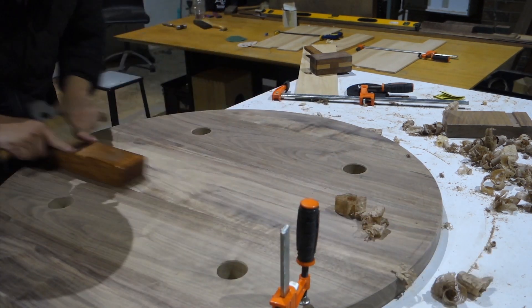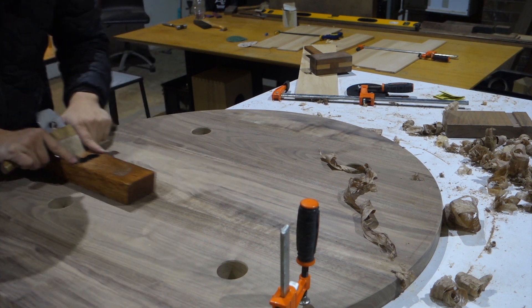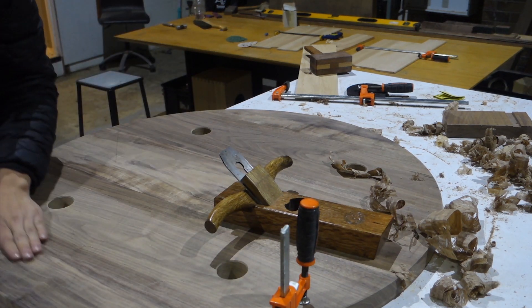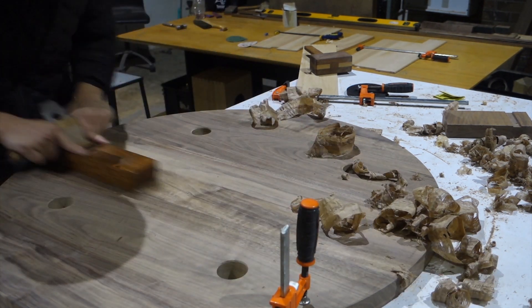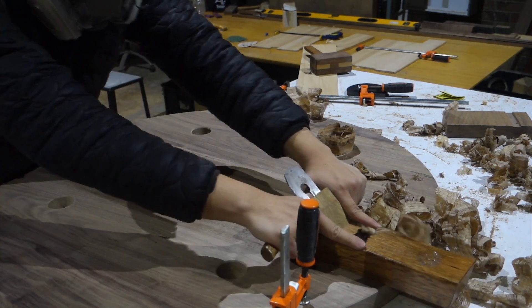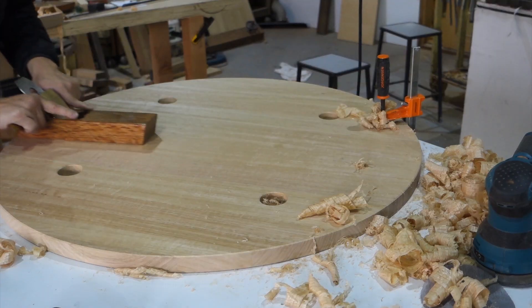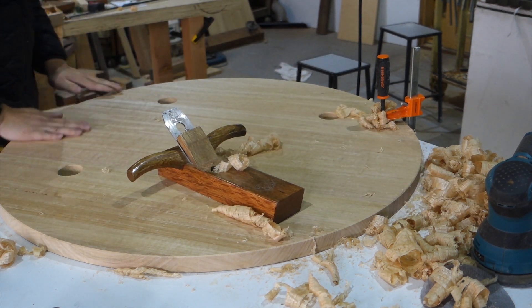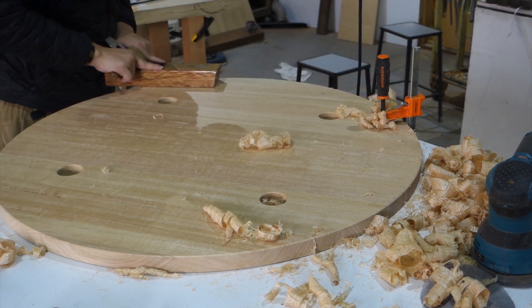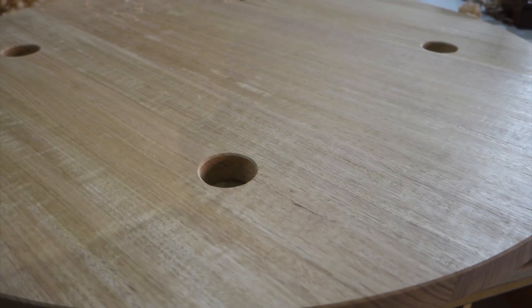Here I'm using a hand plane to clean up the tabletop. It's a Chinese hand plane, a unique style originating from the Suzhou area. Normally the shaving comes out on top of the blade, but this style has a separate opening for the shaving ejection. I think the Chinese style hand plane is really underrated — it doesn't have enough recognition from the woodworking community. This quarter-sawn Tasmanian oak comes out really nice after planing; I could finish it straight away without sanding.